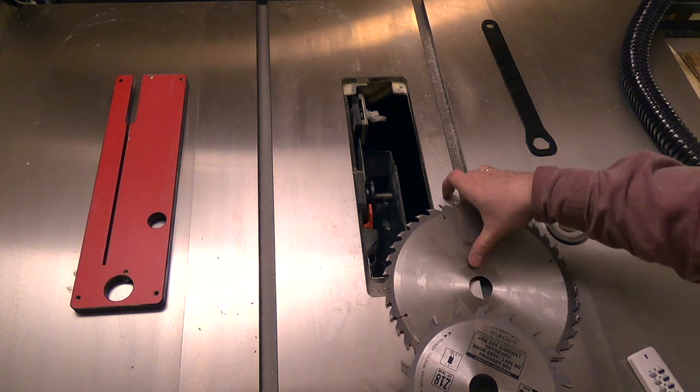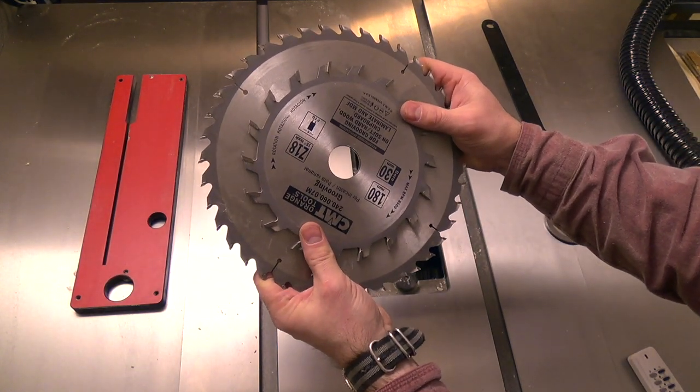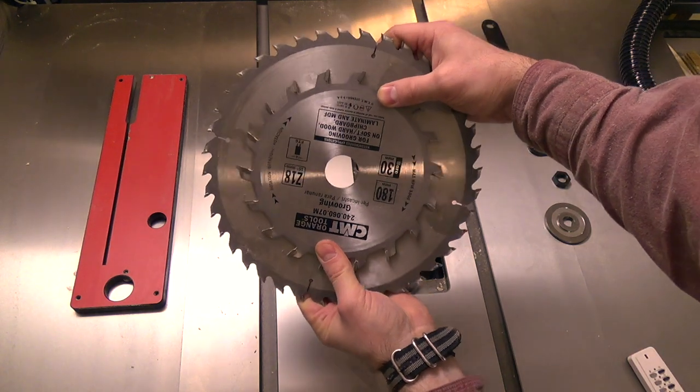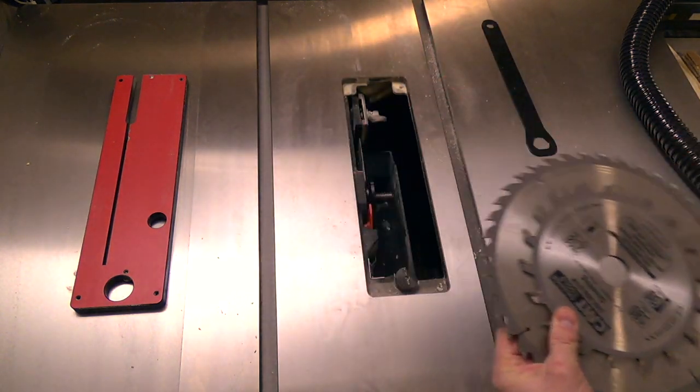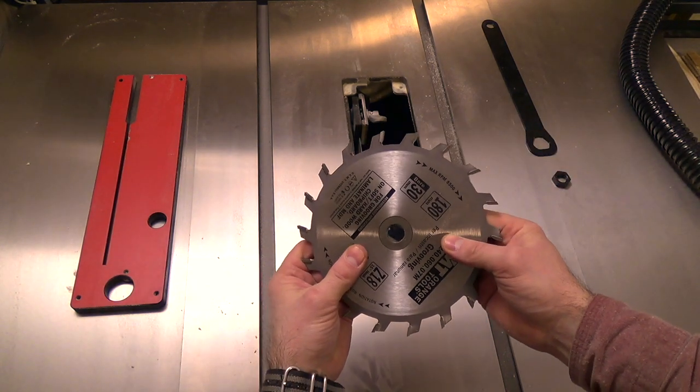The saw has a 30mm arbor, meaning that my CMT grooving blade fits, which is really nice. The saw accepts a dado stack, but I haven't purchased one just yet. For now, I will use the 6mm grooving blade.